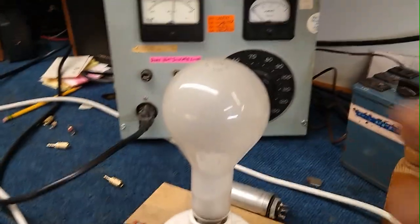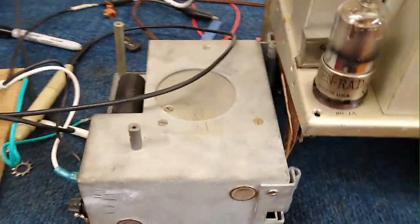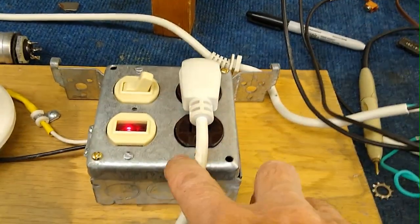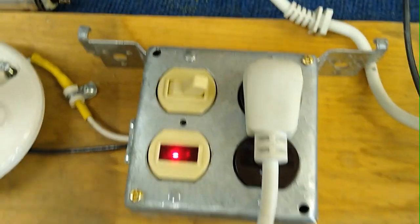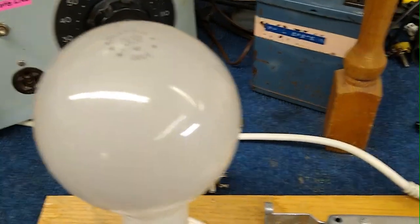This is the current that is drawn. This light bulb represents a fused circuit. In the event there's a short circuit in this radio, or any radio, current flows from the receptacle into the radio. Then it comes from this light bulb, which comes from the power supply, into this light bulb and on into the receptacle. This tells me there's power on to the receptacle. In the event of a short circuit, instead of having a big short here and burning up something, tripping the house circuit breakers, possibly damaging this variac, this bulb will take that current and light up.